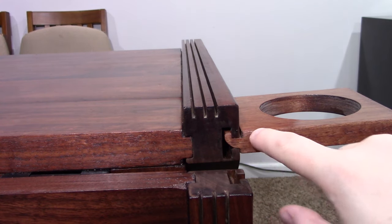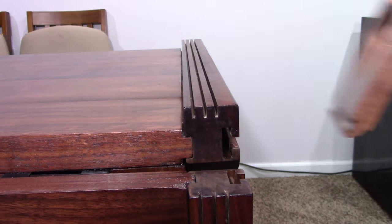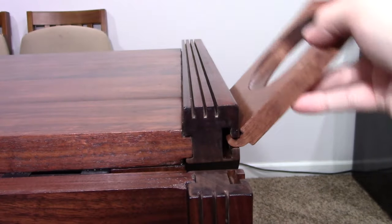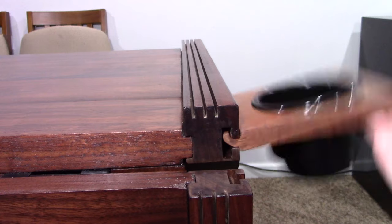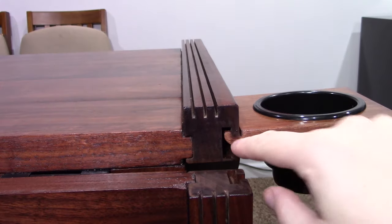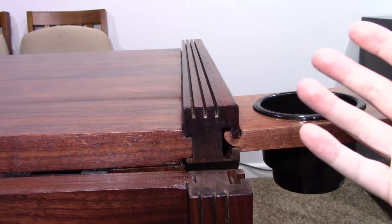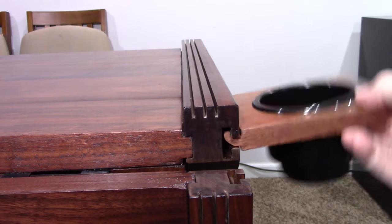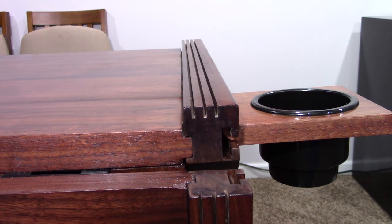Now, the more that you come off of this, the more you clear out on this top, the easier it's going to be to lift this up and get it out of the way. And the more that you round over this bottom here, the easier that's going to be. What I liked was to try to get it kind of snug, because then if there's a little bump and there's not too much play here, it'll actually pinch against that top and push this curved bit down into the wood and stop it. So I'm imagining if someone's at the table and they get up or their knee kind of bumps something, there's a little bit of a catch to it. You can blow past it, but for little bumps and stuff like that, I thought that would be kind of helpful. So that's how I set up mine.